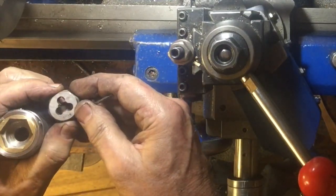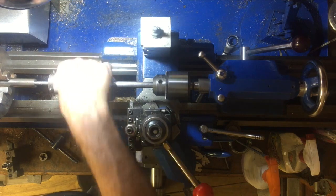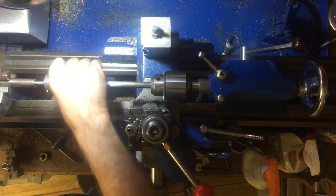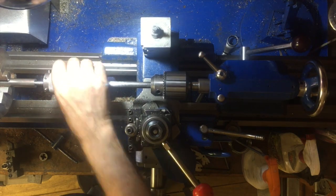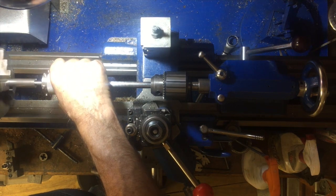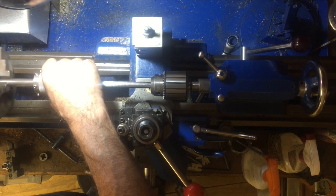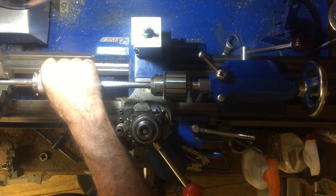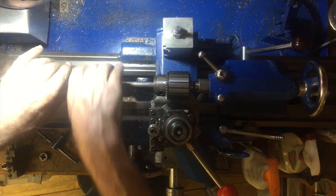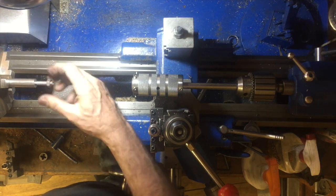This is made from a piece of 40 millimeter diameter solid stainless steel bar which started life as a hydraulic ram. It is double-ended — you can put a hexagonal die in one end or a rounded die in the opposite end and flip it over. It's knurled so it's easy to grip, and it slides on a half-inch diameter chrome-plated shaft so the die unit can slide in and out, remaining in line with the centerline of the lathe and advance along the thread as you turn it. There are also previous videos about using a circular saw blade as an indexing device and an offset drill, and we're seeing all these gadgets being used in practice here.